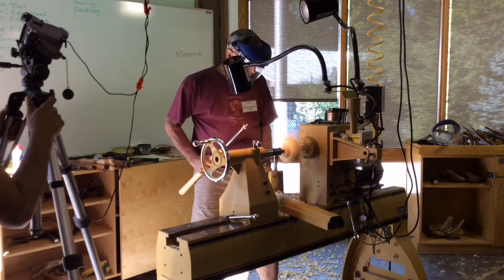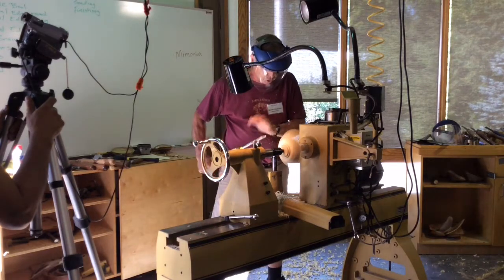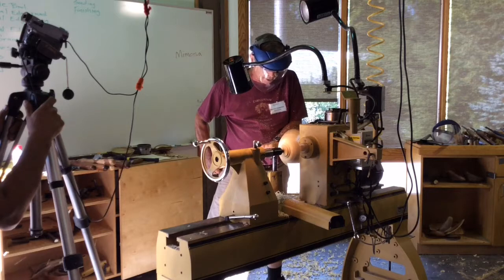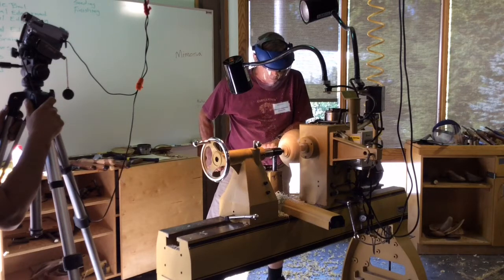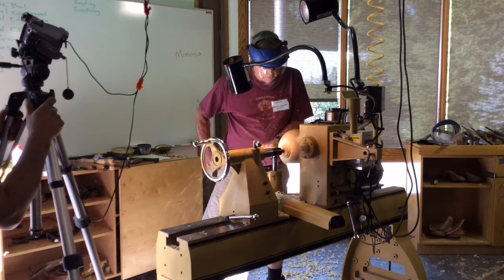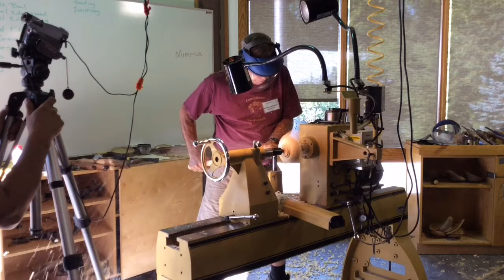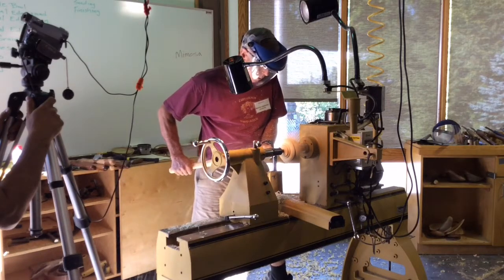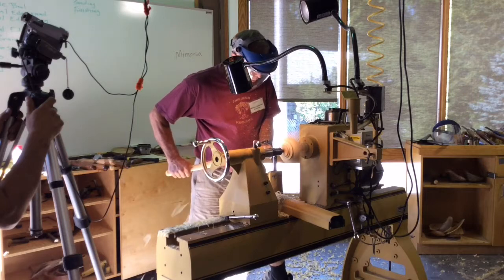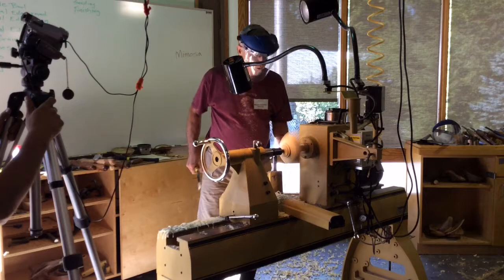And because I want to keep the bark on here now, I'm going to turn around and cut, pushing. Do the push cut, ride the bevel, right back down the line. Lots of pressure down on the tool rest when I'm cutting all that air out there. And here I'm looking for a really nice bowl shape again. Something that has a nice curve all the way around.